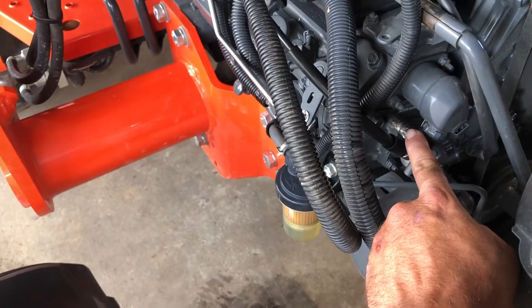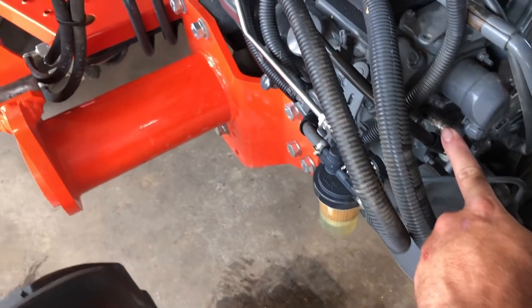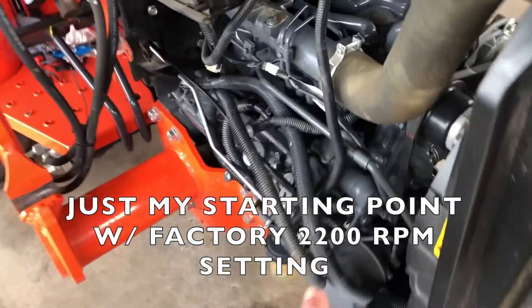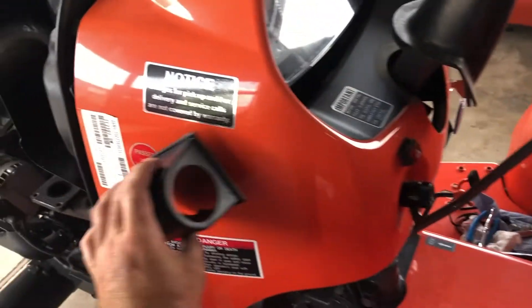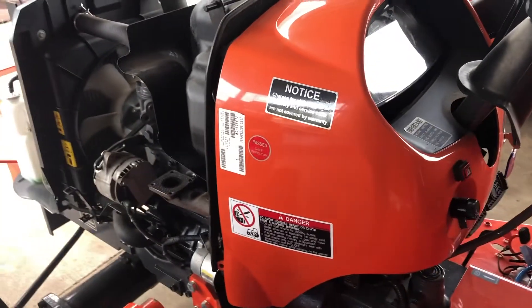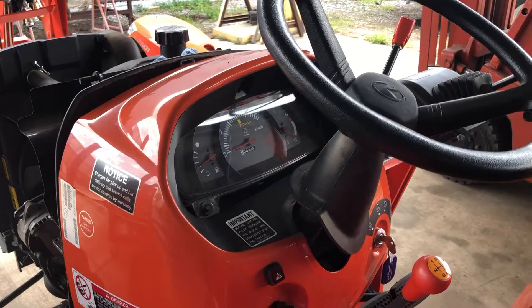I only removed this cap and then I turned out the Allen head a quarter turn — that was recommended in the forums. Of course this could be different with any machine, and I really won't be able to tune this thing and back that screw out enough until my exhaust gas temperature sensor is mounted on my dash. Here's the mount — boom, Amazon, I'll put the link in the description. I bought an auto meter gauge so it should be a good quality piece out of this tractor.